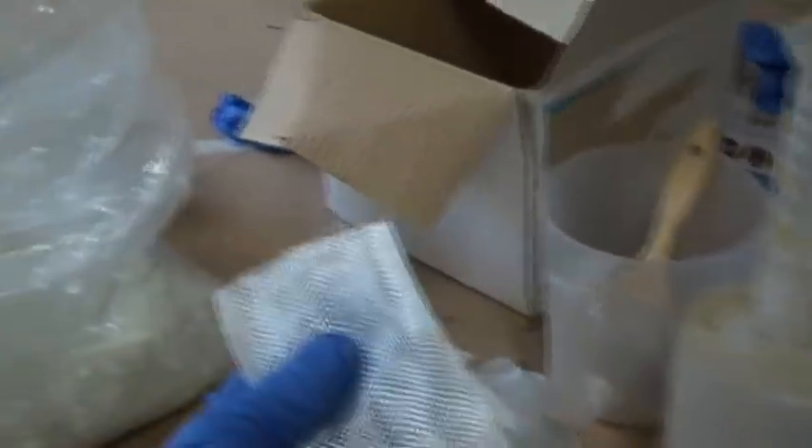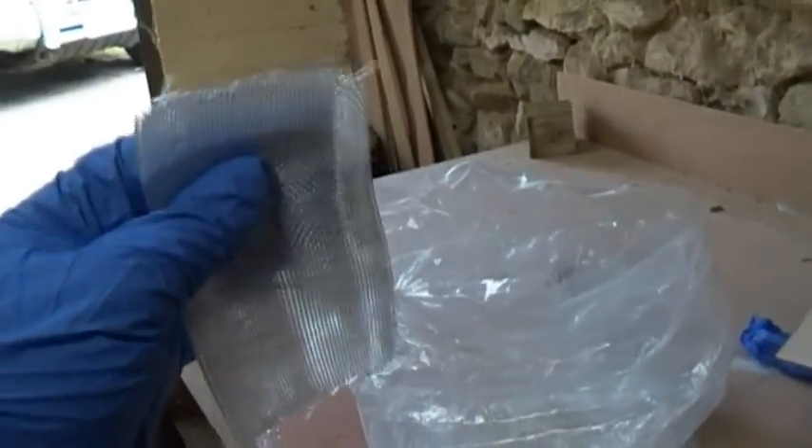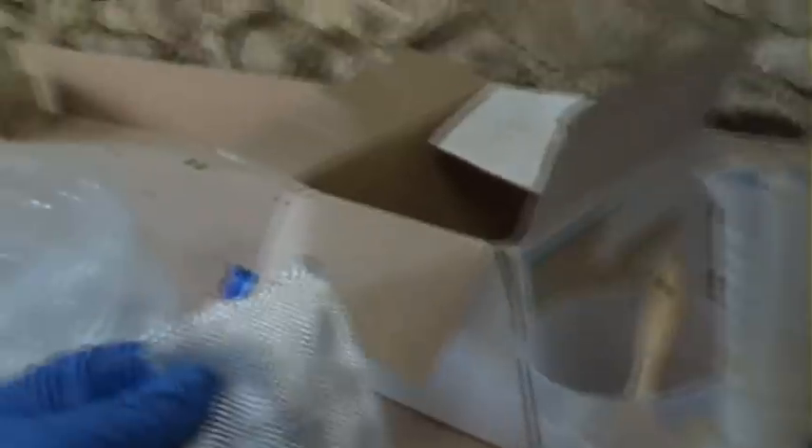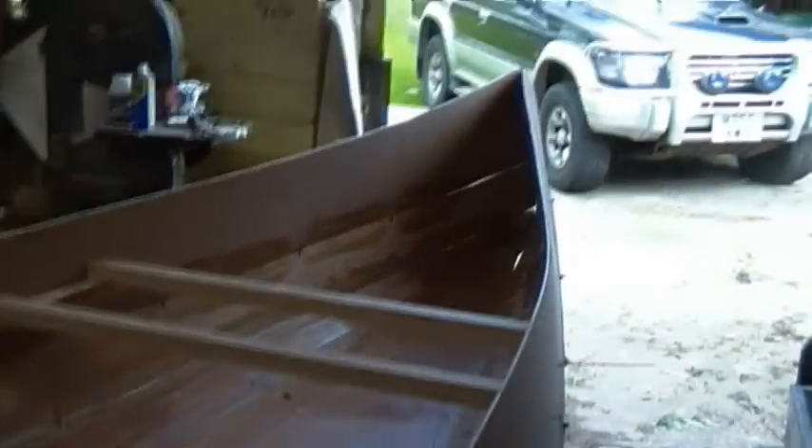Once that starts curing, I've randomly cut up small pieces of 75mm tape. I'll be using just resin in the pot with a two-inch brush, putting that on the inside covering everything, sealing the two sides of the panel and encasing all that padding. The reason I've cut the tape into short pieces is because it's curved on the inside — if you try to use it in one length it starts buckling up and looks really messy. Keeping it in short pieces keeps it nice and tidy.